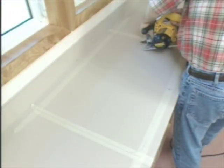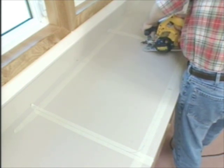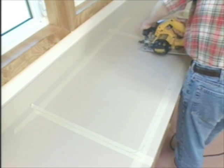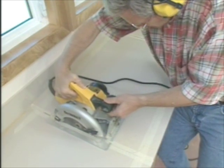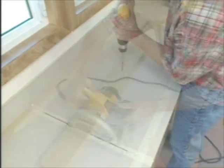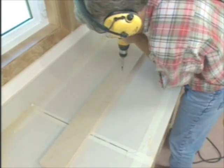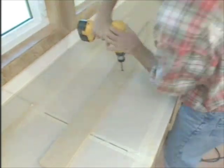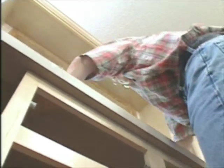To cut the opening, you can plunge cut with a circular saw, which means starting the saw, dropping it straight down to penetrate the surface, and then cutting forward. It works on all straight cuts, but watch out for binding. After cutting the sides, it's a good idea to screw a plank down into the cutout, which is otherwise hard to handle as you finish cutting. Then use a jigsaw to finish the corners. The plank holds the cutout in place as you finish the cuts, and you can just pull the whole thing out when you're done.